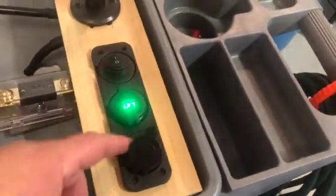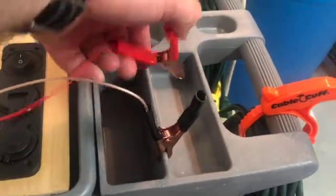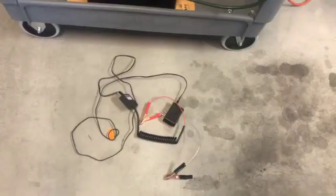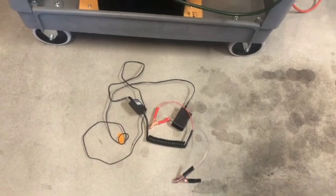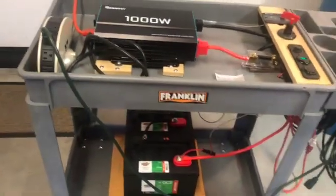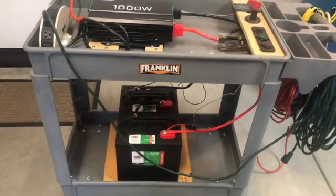It's a really simple system. You can plug in your cell phone here to charge it, or plug in a cigarette lighter. As for charging the batteries, it's easy — I just bought a cheap 12-volt trickle charger from Harbor Freight and put the leads right on the battery. I could also hook up a solar charge controller, hook up a generator to charge the batteries, or even run some leads from a car. It's a very versatile way to charge these batteries. I hope this helps — please like and subscribe for more DIY videos.